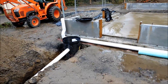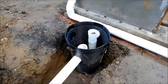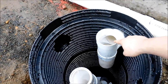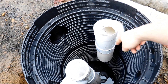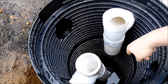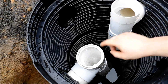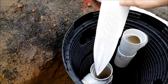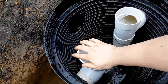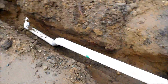This black tub base is the pot that filters all the stuff off the roof. What you see inside is the inlet tee. All the rainwater comes from your gutters, out of this tee into here, goes into the basin and all the leaves, pine needles, and everything settle on the bottom. The outlet is 4 inches lower than the inlet, and in the outlet is a filter sock, which keeps any debris from going down into the eye pit.